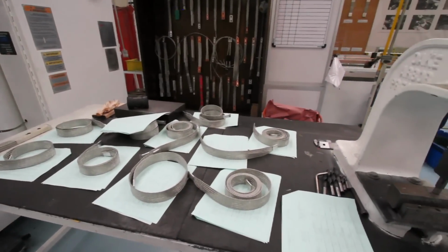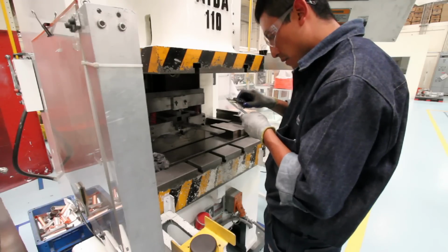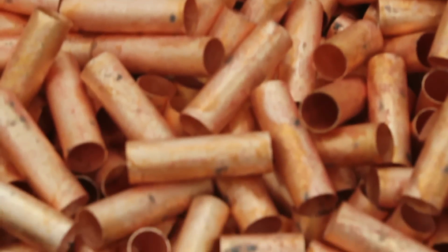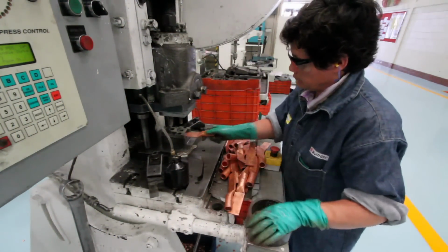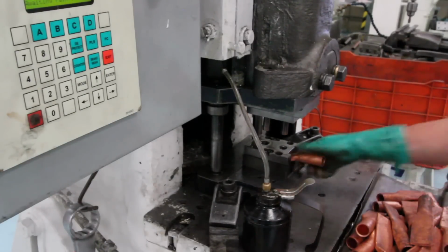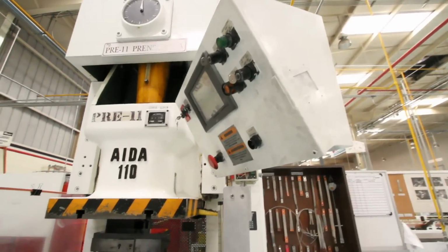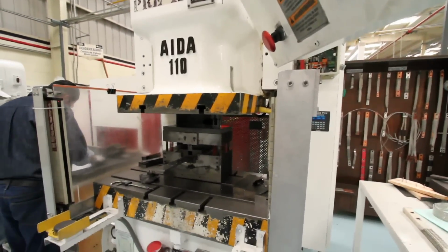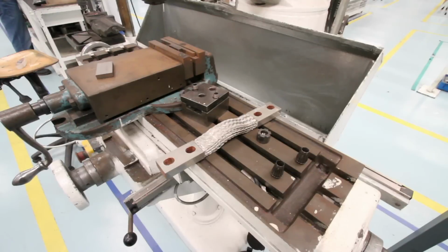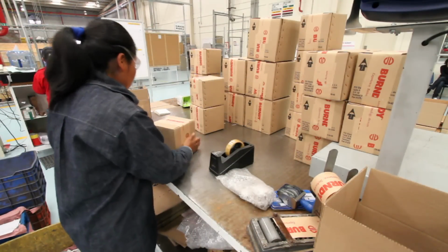The whole process of this product follows the plan established under the work order being manufactured. The process begins with cutting the copper tubing for the manufacture of the splints that are the ends of the connector as finished product. This tube goes then to an external process, whether washing, stripping, tinning, or special processes such as plated coating. After that, it comes back to the production floor and the braid is cut, which is inserted into the tubes after these have been crushed before. Then it is given dimension and finished making the manual crush, hydraulic crush, ferrule crush, sanding, packaging, marking, and inspection. After that, it is entered to the warehouse and delivered to the customer.